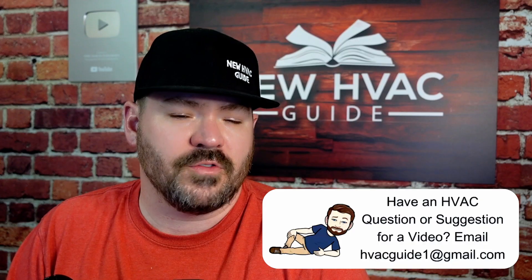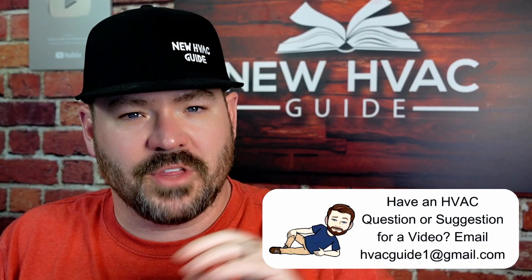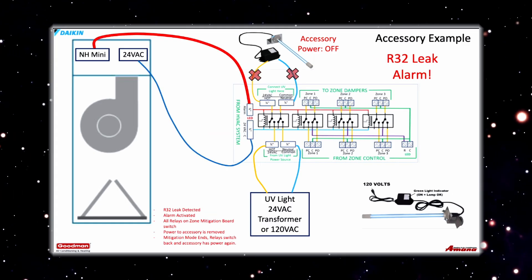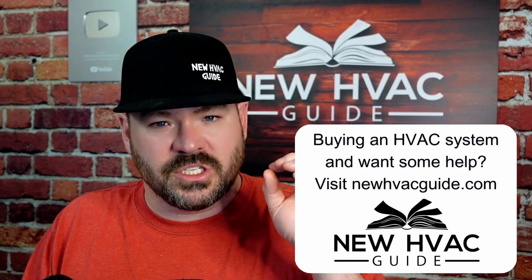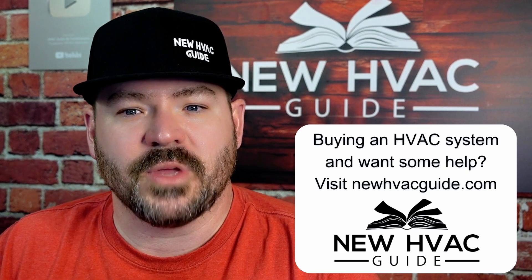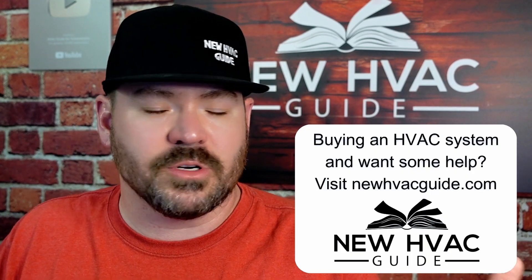Just know your accessories — you've got to keep an eye on how it's all wired. If you're killing power to things on the load side of this terminal, you've got your line voltage coming in that would normally power those accessories, and now you've got the board inserted in between with that low voltage wiring, killing power to those accessories. Are there situations where you might need more than one board? Yes. Are there situations where one board kills multiple accessories? Yes. So whatever transformer is feeding all of this will need to handle that load — and could this board feed power to a relay that then kills all those accessories? That's worth considering.